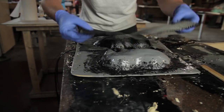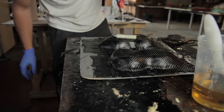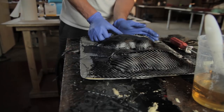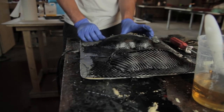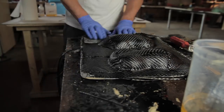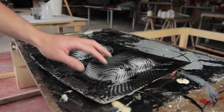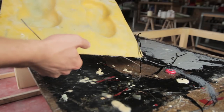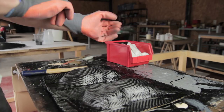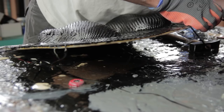I'm using chopped carbon fiber around the flanges at tight corners to ensure there's no bridging, because when laminating with carbon fiber cloth it's very easy to get small voids on tight edges that will snap off during demolding. I'm using scrap pieces of 650 carbon fiber — it's just for a mold so I don't mind it being slightly resin-rich, but try to avoid excessive resin richness as it can cause shrinkage issues. I use carbon fiber specifically because it has approximately the same thermal expansion rate as the pre-preg carbon fiber that will go into the mold.